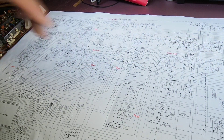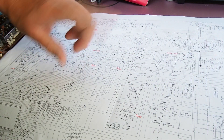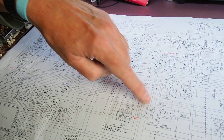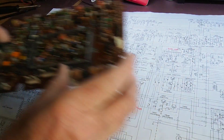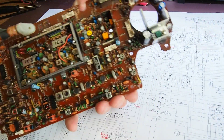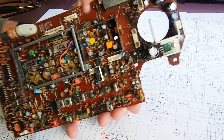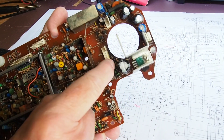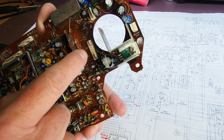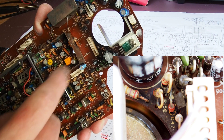This is the power supply. A couple of things to note: first of all, when it's plugged into the mains there is no switch for the transformer, so if it's plugged in — whether the radio is on or off — the mains transformer is energized, and so is this power supply circuit here with the bridge rectifier and various bits of smoothing. The power supply section has the AC supply going in, there's a 1000 microfarad smoothing capacitor, and various other bits of circuitry. It's actually quite burnt around there.